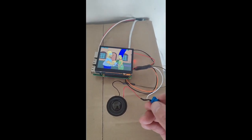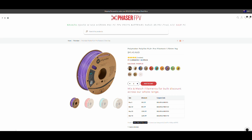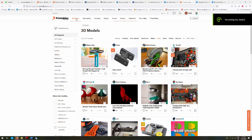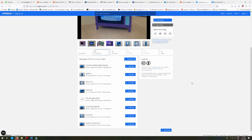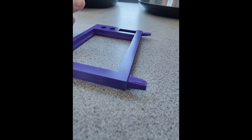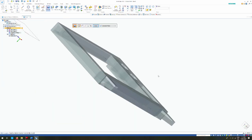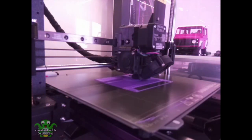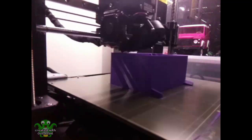Then fire up that 3D printer I told you to buy. I used this purple filament by Polymaker — it looked great, perfect for the job, printed out flawlessly. If you check Thingiverse or Printables, there are lots of models for this project on there, lots of remixes, so you should be right. I found one made for a 3.5-inch screen, so I got lucky. But it's actually not that great — luckily these people will upload not only the STL files but maybe the Fusion 360 files and the STEP files as well, so I can go in and fix these hideous legs. Now you don't need to use supports. Print that shit, put it all together, see how it looks, make sure everything fits, and keep testing along the way.